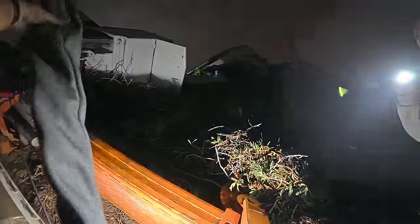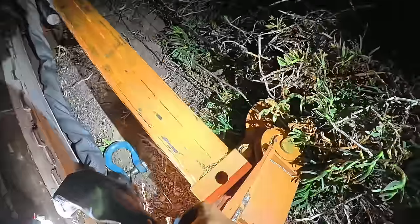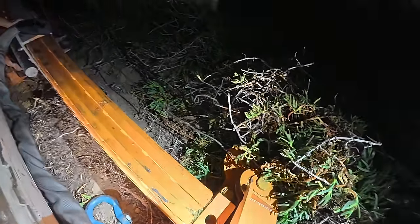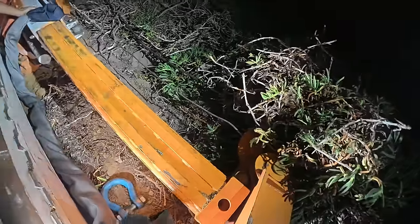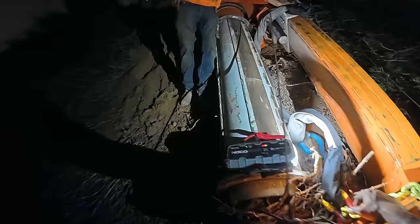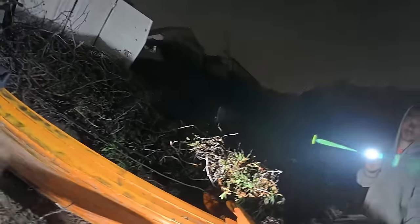You guys want to know the working load limit on this one? It's a strap, right? But guess how much? Like 20? 40. 40, man. And it's a lot lighter than carrying chain. It has a 7-to-1 ratio. How much does that one cost? Probably like $600, man, for one. They're expensive. I'd rather use this than just strap on to a harness, you know? So if it snaps at 7-to-1, 280,000 pounds is what realistically will break it, but safely to work with, 40. It's a trip how they make these things now.